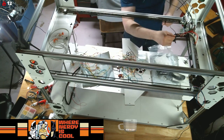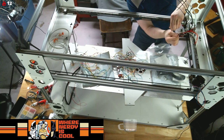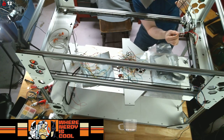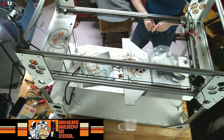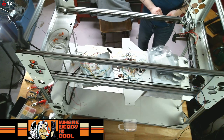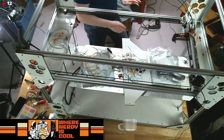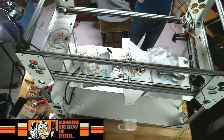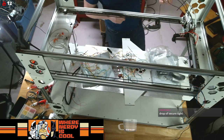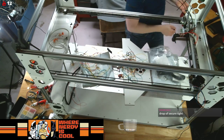I wonder what it would cost to get one of these PCB pieces and not have these connectors on it. See, with those springs, the minute you pull on those wires, it pops right out. And guess what the printhead does? The printhead pulls back and forth. Hey, stop playing the packing. So the point I'm trying to make here, without ranting, is that I would never put spring connectors on a moving part.